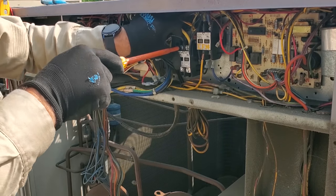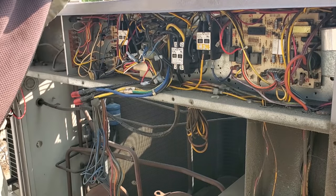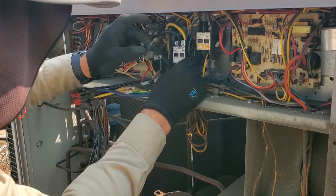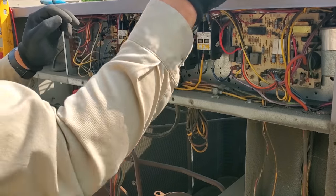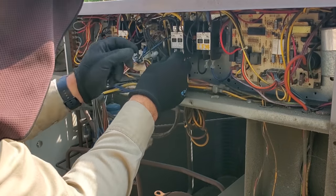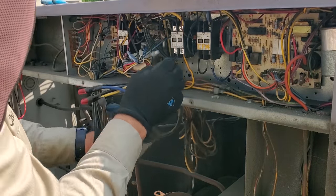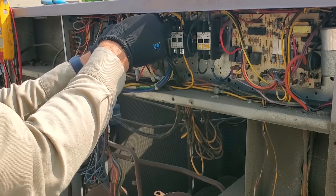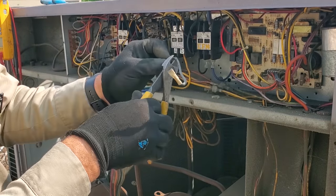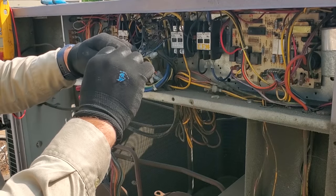We don't know what caused the burn on the contactor. It looks to me like it was a loose wire, but then again the lug is pretty tight in there, so who knows — could be damage to the compressor, could be all kinds of things. Everything looks good in there. There was a little collateral damage on this wire right here — looks like it's for a condenser fan motor, and there's enough wire to cut off the burnt piece. There's a burn mark right there, so we've got enough extra wire to cut it back, put a connector on there, and try to start this back up.